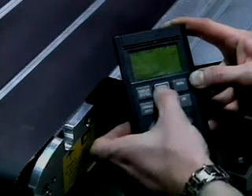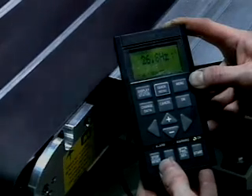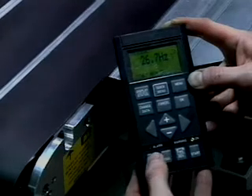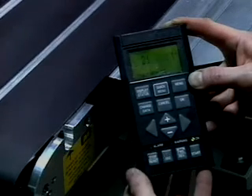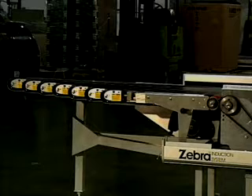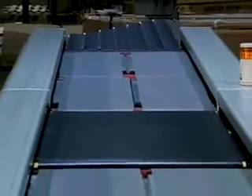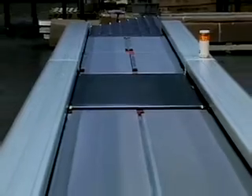Another key advantage of the Zebra involves the Profibus machine controls being integrated into system controls, which provide remote dial-up to access the performance of the inductor, allowing Mantissa to assist in troubleshooting. The Profibus machine controls also provide graphical system status of inductor motors and annunciation of status of the inductor photo eyes.